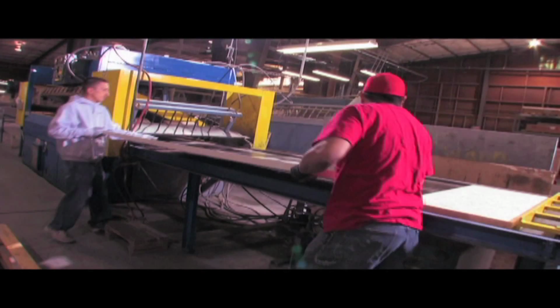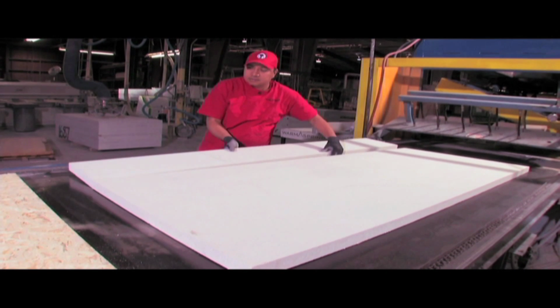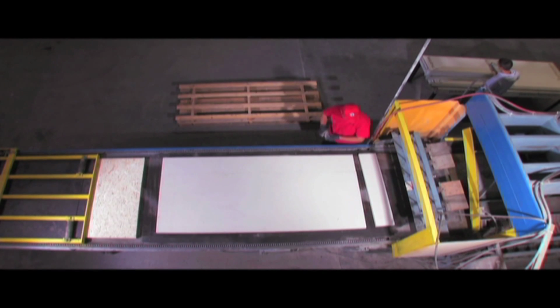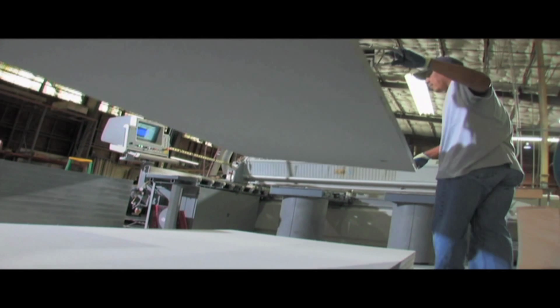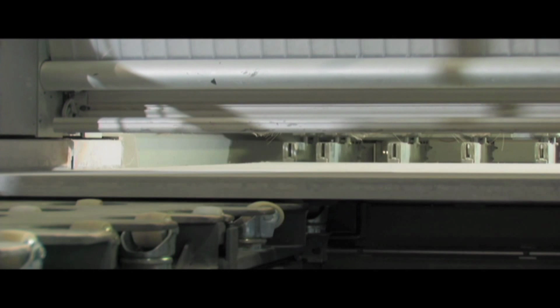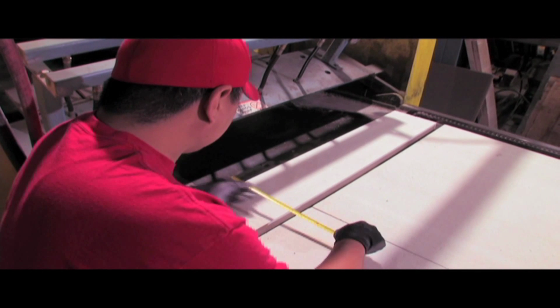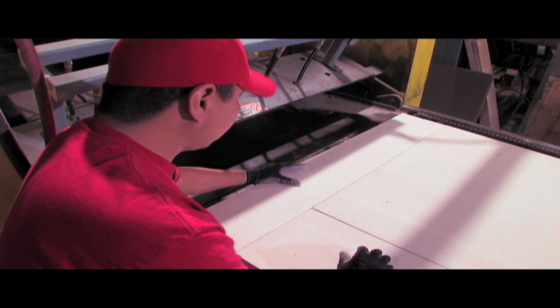If the core needs to be larger than the one-piece core provided, you can accomplish that by laminating pieces together using PVAC adhesive to bond all joints between core pieces. To do this, cut your core pieces to size so when they are assembled, they'll make a core that is the size you need. Be sure to follow the guidelines of the certification you are following for the number of pieces that you are allowed to use. In this demonstration, we're bonding 3 pieces together.